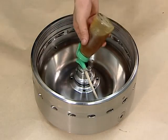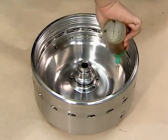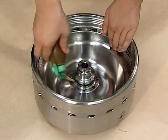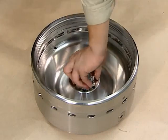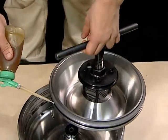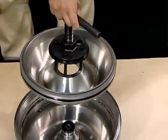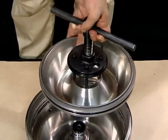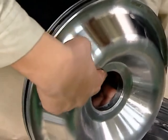This is the procedure for mounting the main cylinder. Lubricate the O-rings and mount them on the main cylinder so that they cannot twist. Set the bowl head jack, push bolt and handle onto the valve cylinders. Fully lubricate the sliding parts on the bowl body and valve cylinder and set the patches. Gradually loosen the jack handle to align the 0 mark on the main cylinder and the bowl body and notch position.